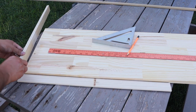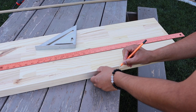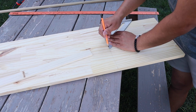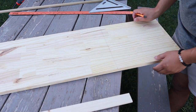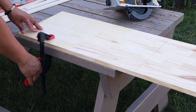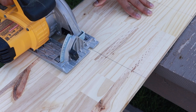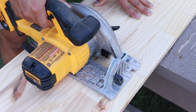First thing I'm going to do is measure out the project panel and cut it to the right size — just under two feet, because we need to account for the thickness of the little boards. I'm making a simple frame for this board that will be the bottom of our tray. I'm going to clamp it down to the picnic table and use my hand saw. If you've never used one before, don't be intimidated — it's very simple. I don't have a table saw but I do want one.